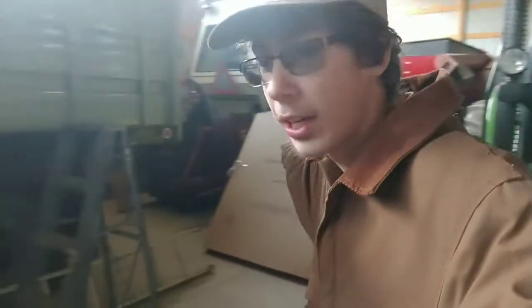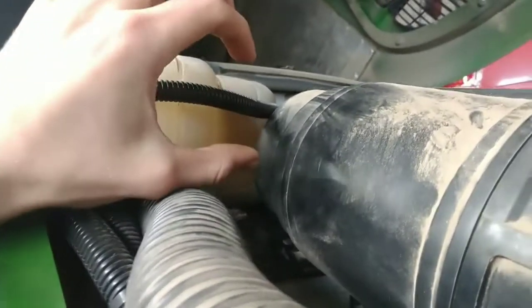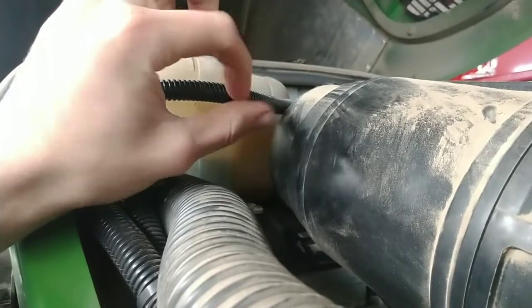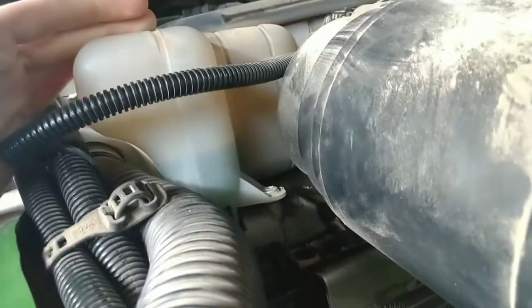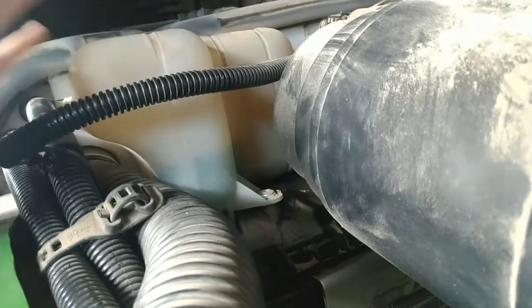And it's probably leaked more fluids than that tractor back there, which is almost 50 years old. The reservoir right here is leaking. There's an O-ring that goes down below into the radiator — it's about that long of a tube. There are two O-rings, one on the bottom and one on the top. And somehow, someway, it's leaking out of that O-ring. That's what we think is wrong with it. But it's almost virtually impossible to change that O-ring out because they've got it riveted into the radiator.